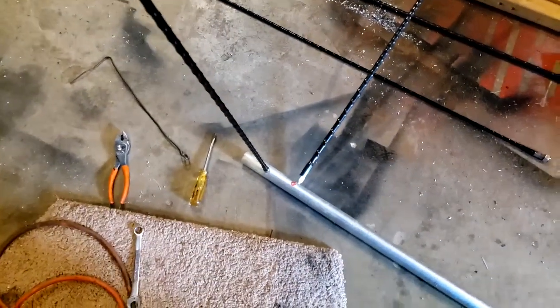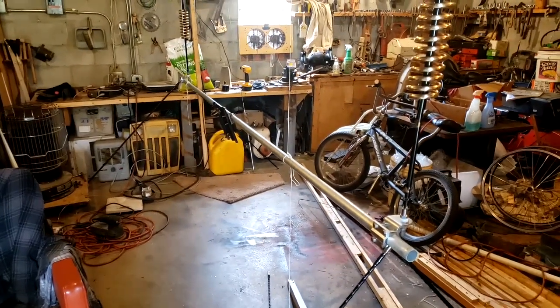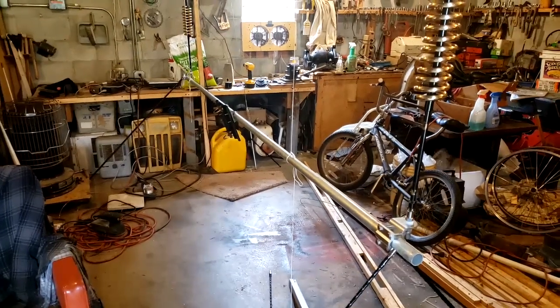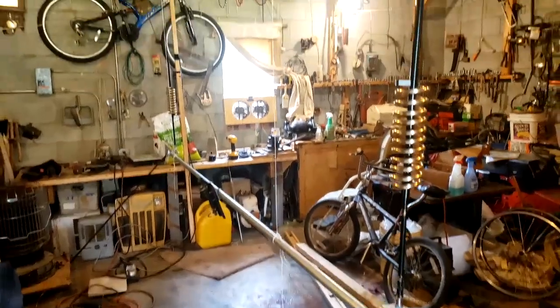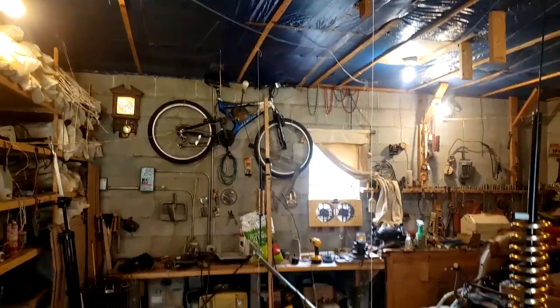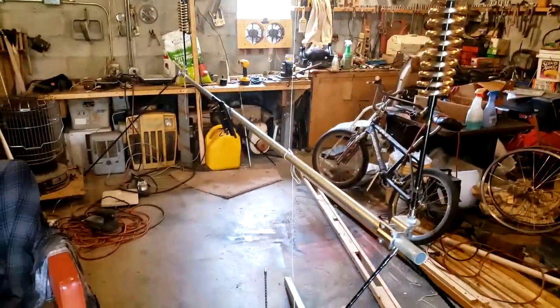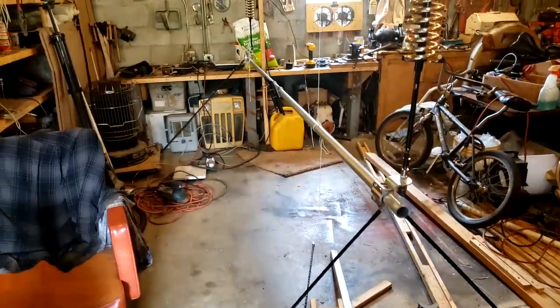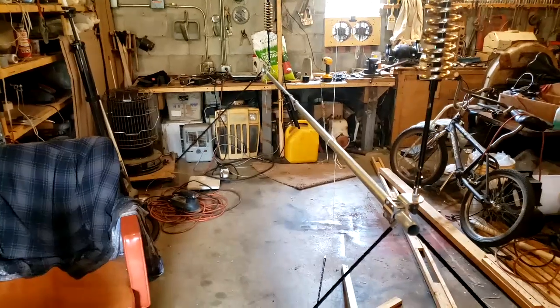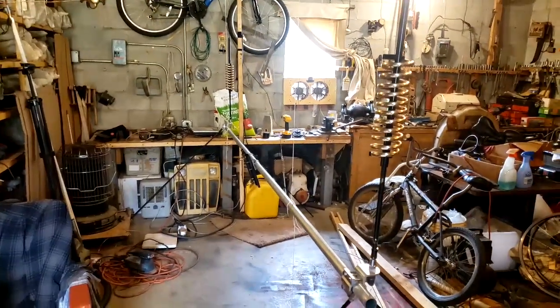One end is together — well, almost. I don't have the mirror mount bracket on there yet, but the ground plane radials are on there. At my wife's request, Barbara said I should take a video of the test assembly. Nothing is tightened up yet; it's just put together. I had the coily whips on there just for trial purposes because the 102s will hit the ceiling, but these will just clear with about a half inch above them, and the radials are just about on the floor. This is floating — I have it strung up to the ceiling. The ground plane radials came out fantastic and they do look to be 42 to 43 degrees. It's going to be a dual directional ground plane co-phased.